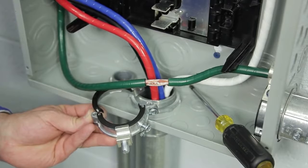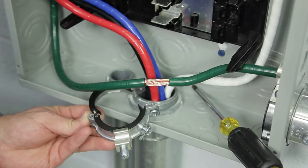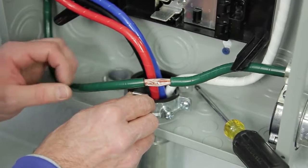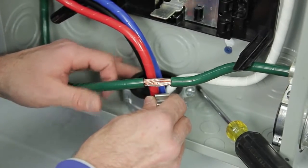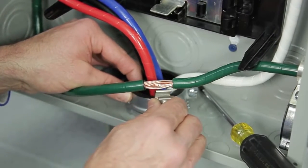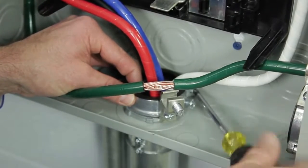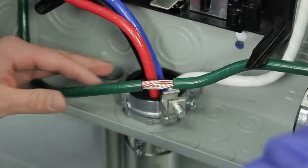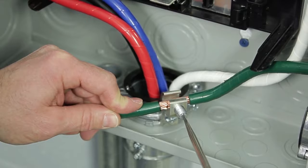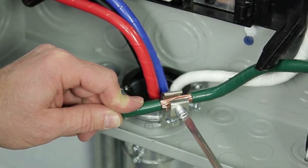Mighty-Right bushings are suitable for use with threaded rigid metal conduit, intermediate metal conduit, or threaded fittings. To install, simply open the split grounding bushing, position it around the conductors, ensuring 2 full threads of engagement. I recommend that you set the bonding screw, position the clamp screw, and the lay-in lug screw for easy access. Tighten to torque requirements that are clearly listed on the carton labels.